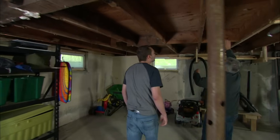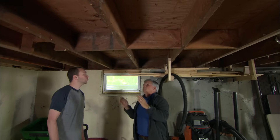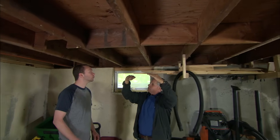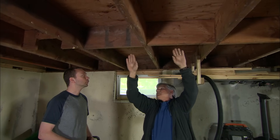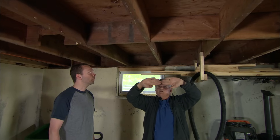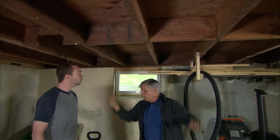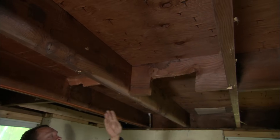There's one more thing over here — you see this blocking that goes between your floor joists? It's very important. Solid blocking, or bridging, transfers the load from one joist to the ones on either side of it. When someone walks on the floor upstairs, the joist wants to deflect. If the blocking is cut in there tight, it wants to twist but can't, so it transfers the load to the joists on each side. But when someone breaks a big hole in it or removes it, that joist has no one to share the load with.